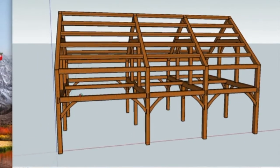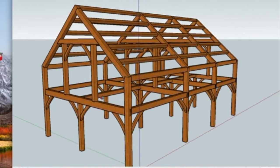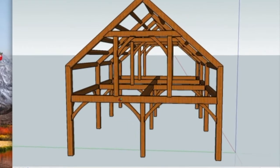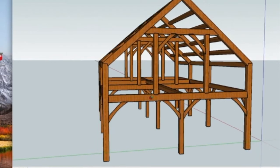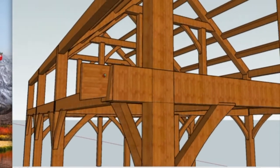I'm not exactly sure how big that little section is going to be, but the main working space is about a thousand square feet downstairs. The posts are quite tall, so the upstairs functional working space is just around 800 square feet — that's 1,800 square feet overall plus the little lean-to. That's not a really big building, but it ought to be a massive improvement from what I have now, and by its design it will be quite easy to add on to later. The building contains a number of really interesting joints I plan on documenting in the video series — just one example is the wedged half dovetail tie beam to post connection. It'll be an interesting joint to lay out in rough timbers, and I plan on documenting the layout process as well as the cutting process for that joint really well.